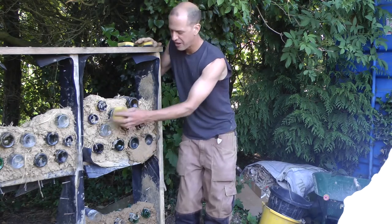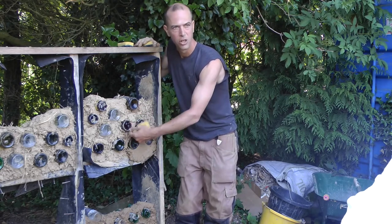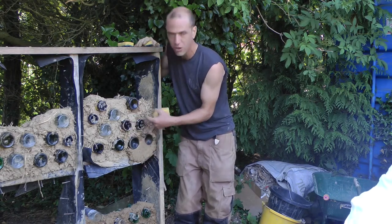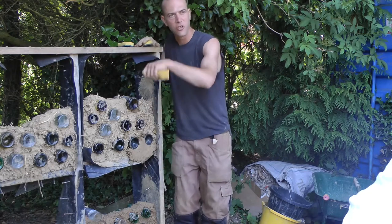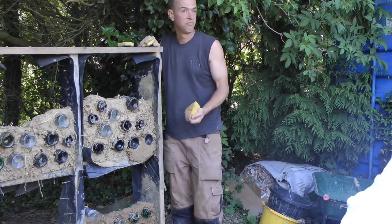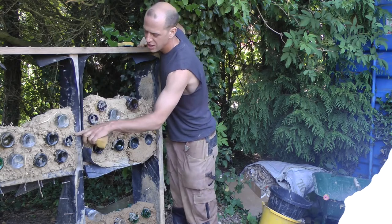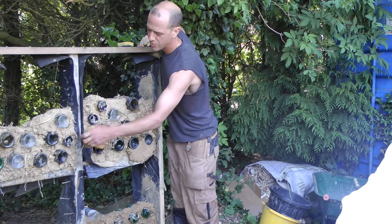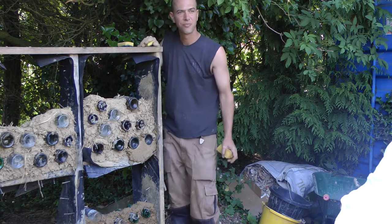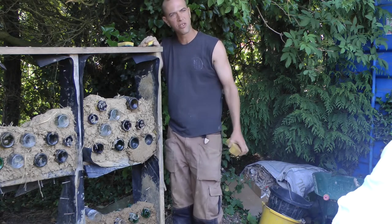You might do this for a section and then, if I wanted to put some mosaic in, I would carve out, maybe with a little metal tool, the places where I want the mosaic tiles to go. Say I wanted it to go everywhere in here, I would do the whole thing like this, and then afterwards carve it out before it's gone completely dry and hard. That's one way you could do it. Or over here, render it all, but then in here, recess your pointing back a bit, so that you can come back and add the thickness of the mosaic pieces.